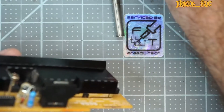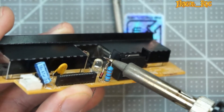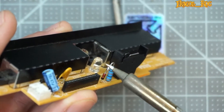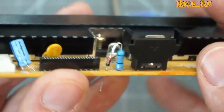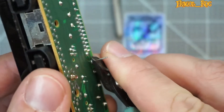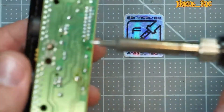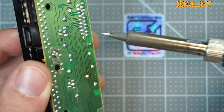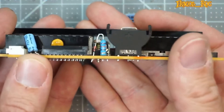Let's go ahead and get some solder on the tip. There we go — just clean that up a little. So now we have the solder there, and just to make sure everything is in there nice and secure, I'm going to clip off the excess component leg, throw some more flux on there, and just touch this up a little bit. There we go — and there you have it, we have the diode.